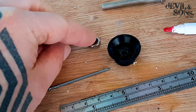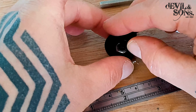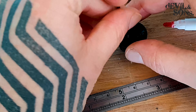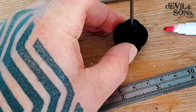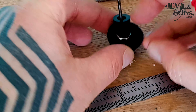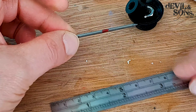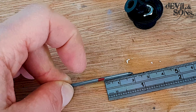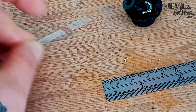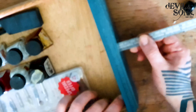I've got a nut and a spacer — I'm going to simply put the nut on top, so that'll be where the nut is, and that'll be where the spacer will be. I'm going to put my nail through so it touches the end of the volume knob. This is now the length of the bolt that would be inside there. Then I'll get my pen and mark there, and measure from the tip of the nail to that line. It's just over two centimeters. So essentially, I need my bolts to be a length that equals the width of the drawer plus two centimeters.